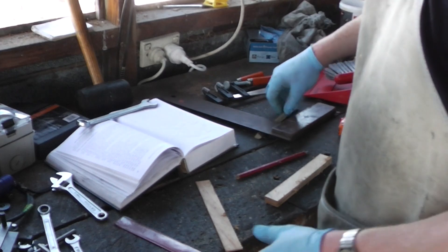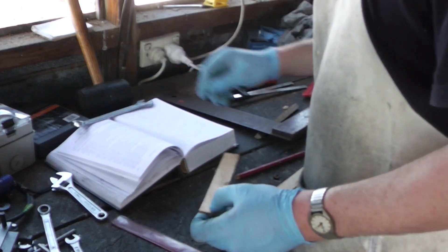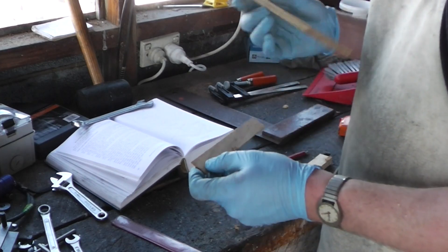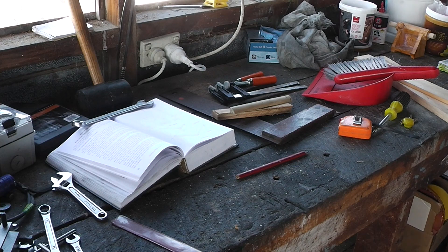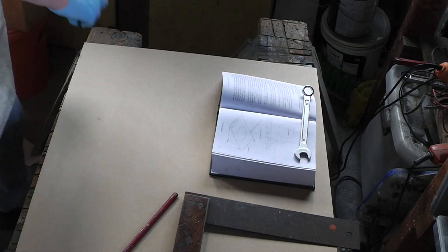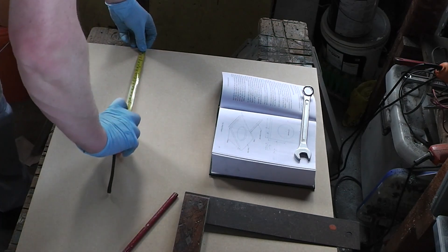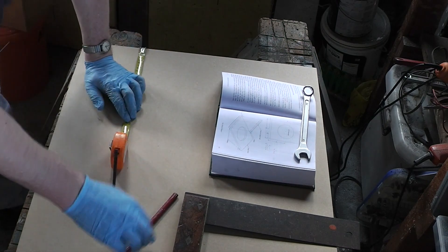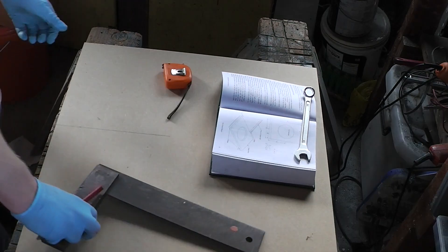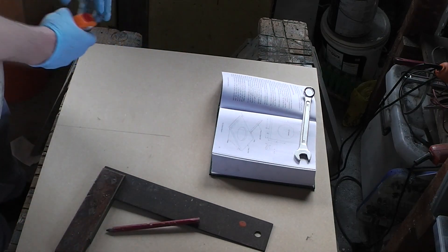Let's move the fence again to 25.4mm. Well, that's a stroke of luck — this is pretty much the trim I need to go on the opposite side. Didn't plan that, but sometimes you get lucky. This is the rough stock I'll be using: one side is 11.25, the other side is 7.38.